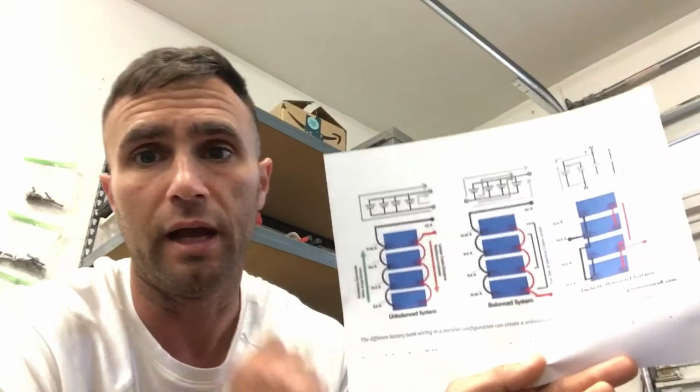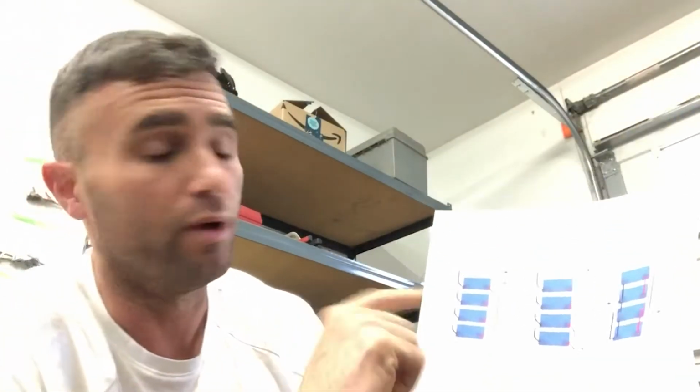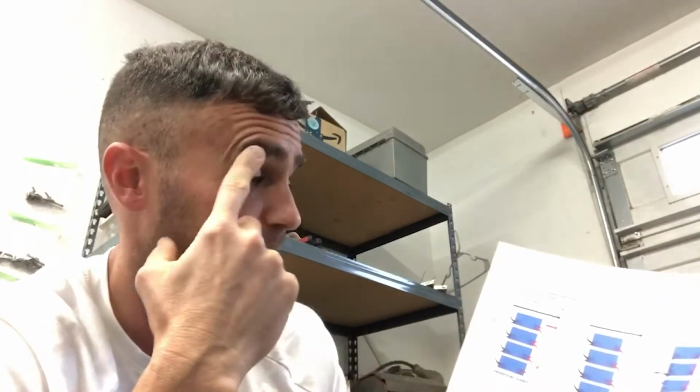So anyway, I woke up this morning, I'm like, okay, I think I wired the battery bank wrong. I need to put a little bit more balance in the system, and I wanna keep it nice and simple. So I found this online. This is a guy I follow. I have no idea where he's located in the world, but he's an electrical engineer, and he talks about battery banks, okay? So we're running a parallel system here, meaning all the positives are connected on one side and all the negatives are connected on the other side. So we have a lot more amp hours, but we keep the same 48 volt system, okay?